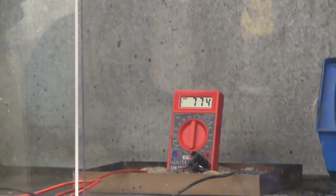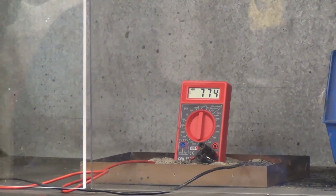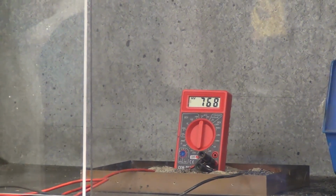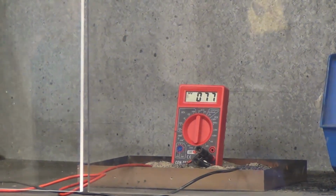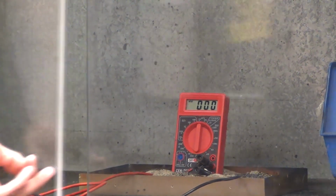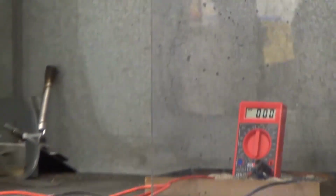Here's a Cat 2 meter, so with more commercial voltages. So you can see that it actually measures 750 volts just fine, okay? And my card's indicating that. Or actually we're putting in about 660. So it's wrong. So now the important part of this is what happens if you put the meter in a function other than volts.